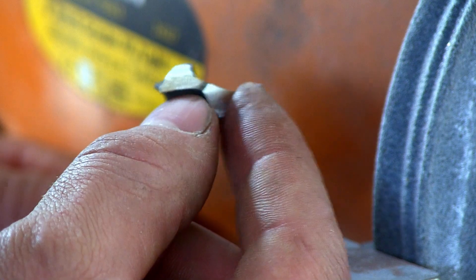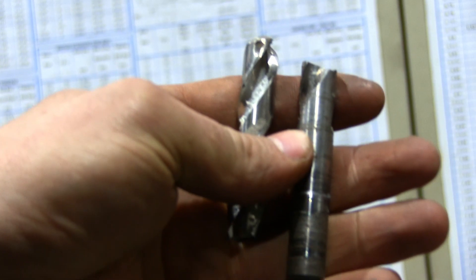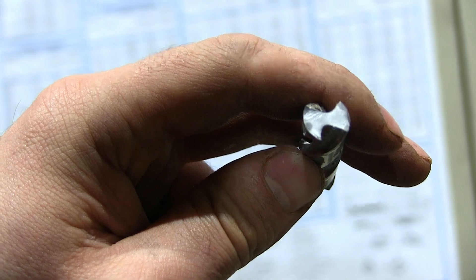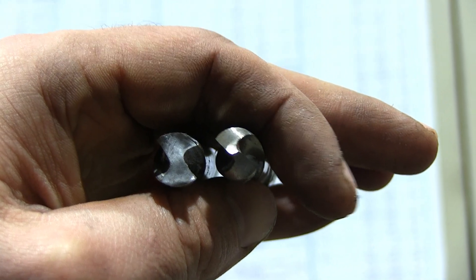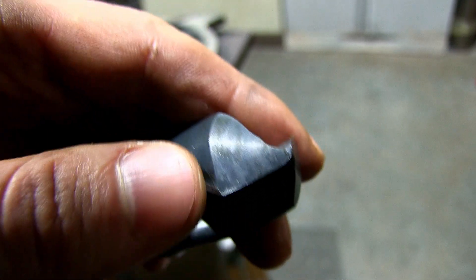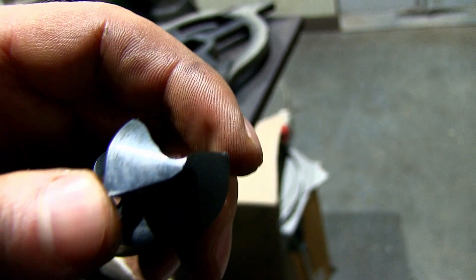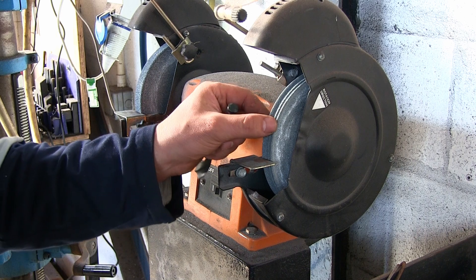The webbing of the drill is not the same thickness as the whole drill. You can clearly see this when you look at a broken drill — at the tip it's very thin between the flutes, but in the middle of the drill it's much heavier. On factory drills you can see little undercuts right at the tip, which allow you to drill with a smaller pilot hole. However, if the drill is old and has been sharpened many times, it becomes shorter and the webbing becomes much heavier.